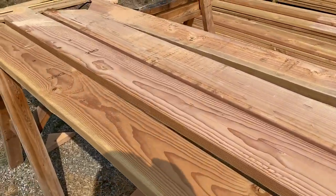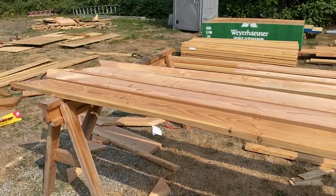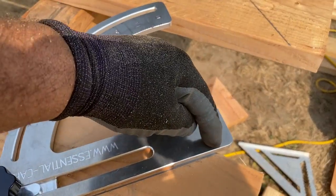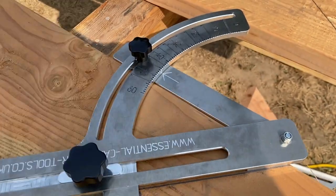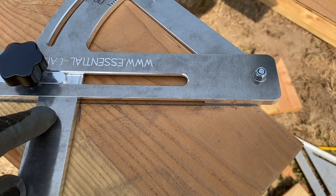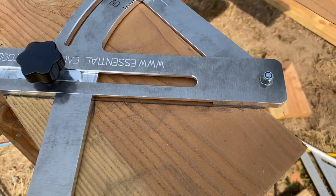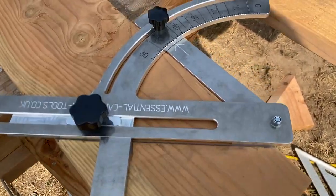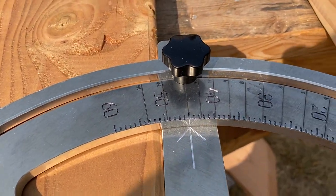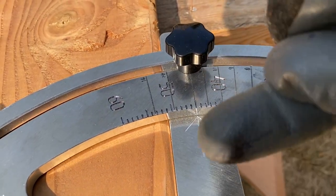The 9-1-15 jacks are cut, and now I have to cut the opposing jacks that go to the two-by-ten ridge, and then we'll start putting some valleys in. One suggestion for this tool: where it crosses over the board, make that a zero and then come this way in inches. My height above plate is six and three-eighths on a two-by-eight, or four and three-eighths on a two-by-six. Also it'd be cool if those 45-degree lines came down in a curve so they'd line up with the arrow — I don't have to look straight down, because I'm off a little bit as you can see.